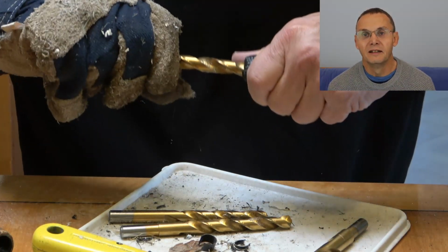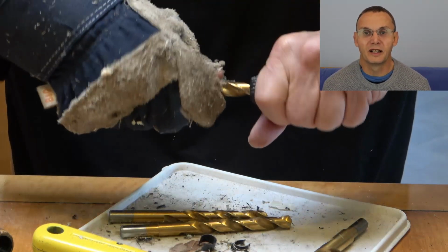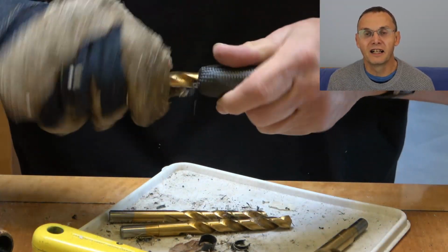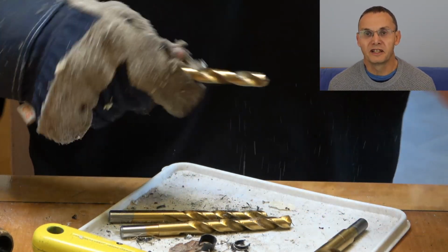Once that's done, it's a question of the actual screw down bit comes with a 10mm diameter, as I mentioned before in my video about the Dave Harrell rod. And it's a case of going through with one drill after another by hand, holding it in a gardening glove, because then the sharp edges are more comfortable to hold. And I start with a 10mm one, which fits fairly easily, then an 11, 12, 13, and in this case go right up to a 14. It's still fairly tight, but it will be okay. And then fit that screw fitting on, get it nice and tight and aligned up with where I want it.